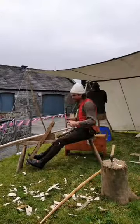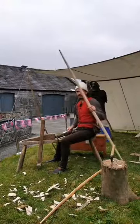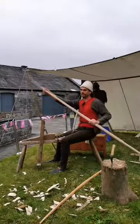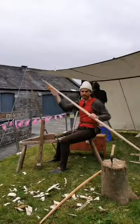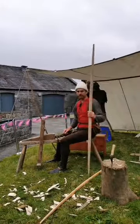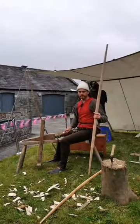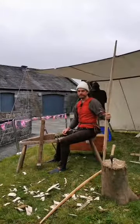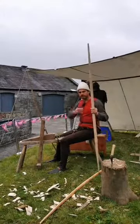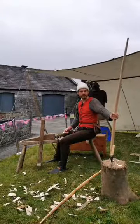The reason the bow needs to be a certain shape — narrow at the tips and thicker in the center — is because when shooting I hold it in the center, draw it back, and the pivot point is the handle. If you had a parallel straight stave and put a string on it, held it in the center, and drew it back, it would break at the handle because all that force is concentrated in one place. To spread that force over the length of the bow, it needs to taper from the center out to the tips.